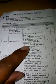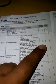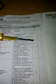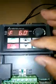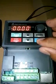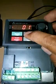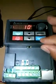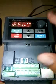In the parameter book, parameter group 0.02 is for parameter reset. I want to use value 10, which sets all parameters to the factory default — the default parameter is set to 0, but I want to make it 10. So let's go to parameter 0.02, press enter, enter value 10, and press enter to confirm factory setting.